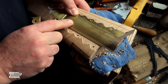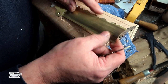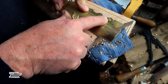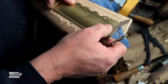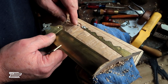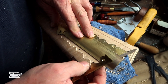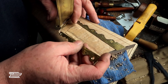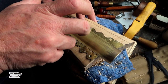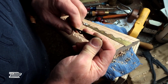The box lid lays down in here, but it's a different thickness metal than these sides because I didn't want to try to make that lid out of something this heavy. So I'm going to leave a little wood edge in here for the lid to lay on when the box is closed. When this is all done, that lid will lay in there between the two brass side pieces. I'm going to leave a little eighth-inch ledge around there and then mortise the box out.